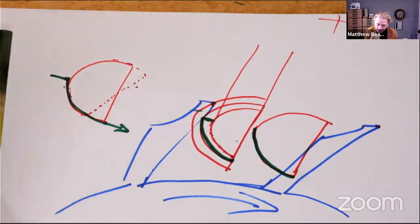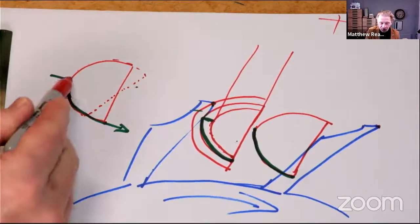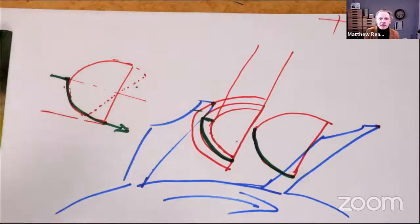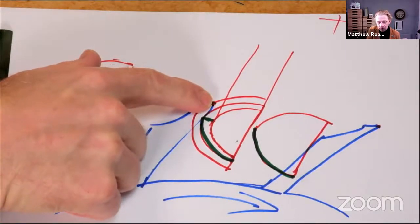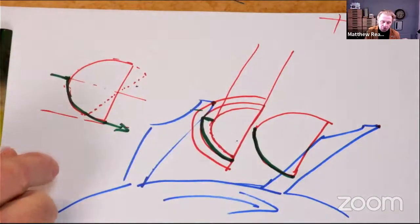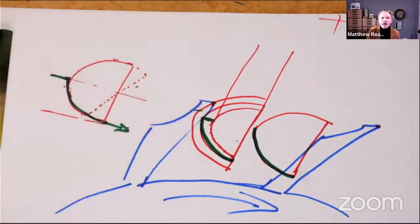That's fine. It does mean that this value is also increased. So very fractionally, the amount that the pallet frame has to rotate in order for the escapement to operate has also increased as well. Anyway, what am I getting at there? Well, first thing is, you can see here maybe that as the clock ticks and an escape wheel tooth, let's say this one, lands on the pallet, the pendulum momentum keeps the pendulum swinging a little bit further, and therefore it keeps the pallet frame rotating a bit further.